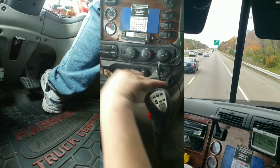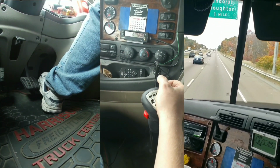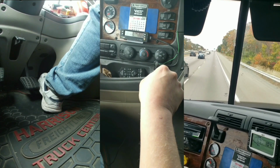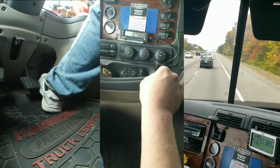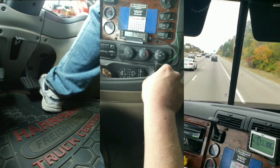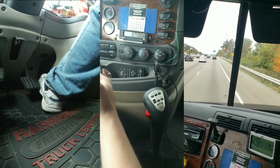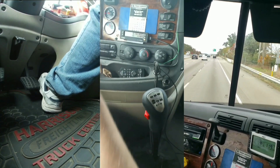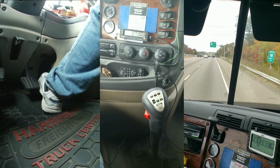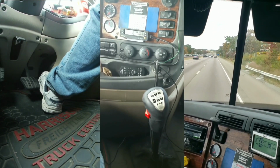Now, when you're in on the throttle, now we're down about 0 right now. I'm off throttle. So I start coming into that throttle just that little bit. I ease in. Wait till around about 10 psi or so, and then I really start giving it the bean, because if you don't do that, the turbo does not have enough time to spool up, and therefore you actually start blowing out a little bit of that black smoke. Black smoke means unburnt, not fully burnt fuel, and that's money out the pipe. Again, no bueno.